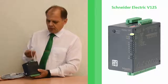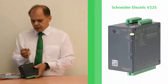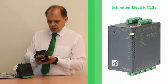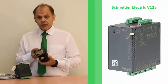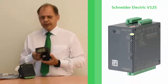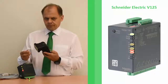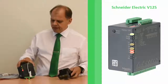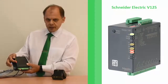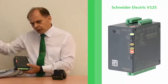Now we can use the point sensor and make a flash simulating an arc flash. I will use a strong flashlight — which is a camera flash — as this is the most recommended way to simulate an arc flash during commissioning. We don't recommend using a hand torch or something with an LED light which does not have high energy output. So now I will hold this on the sensor and I flash. Immediately we will see that we got an activation. We have both sensors detecting the light because they are so close to each other. We will see indication that both trip outputs will activate, and we also have additional signals where we could connect another similar device and transfer the light signal further on.